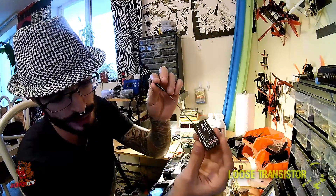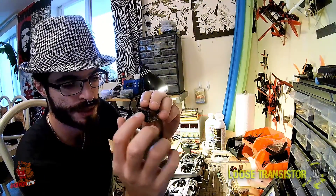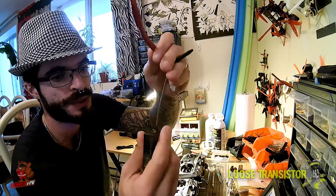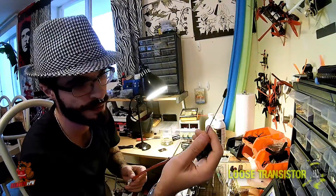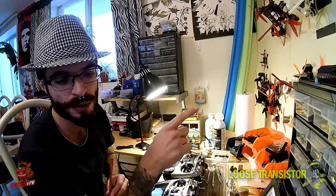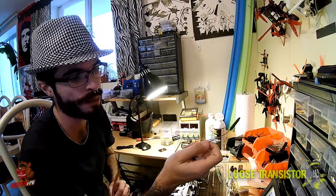That subtle vibration is just enough to let me know I need to pay attention. The receivers are all S-bus compatible, and the ones that come with the radio are kind of big for the mini quad world — full-size receivers — but you can de-pin them and leave just the S-bus connection, converting them into a nice small package with a single dipole antenna. These receivers use dipole antennas without diversity, which is a drawback compared to the Taranis. However, I've found they work quite well. The only time I ever had a failsafe was flying near an apartment building — I think it was just RF background noise — but it was momentary and I saved the craft.